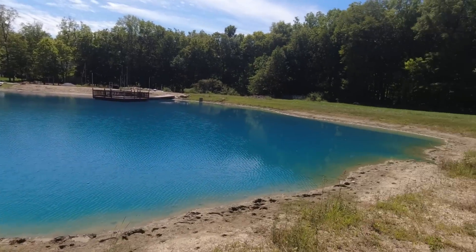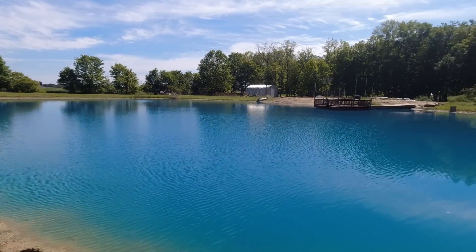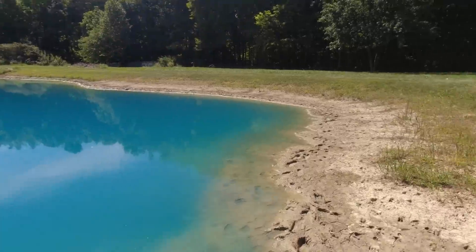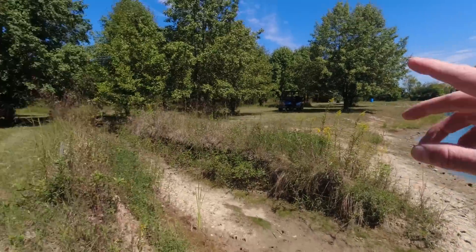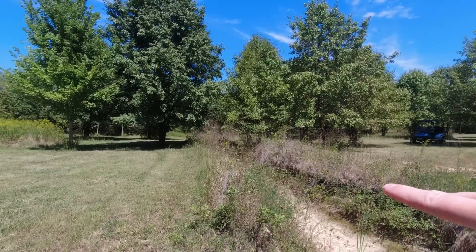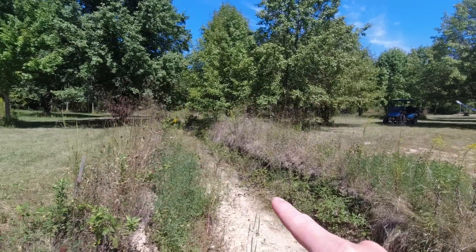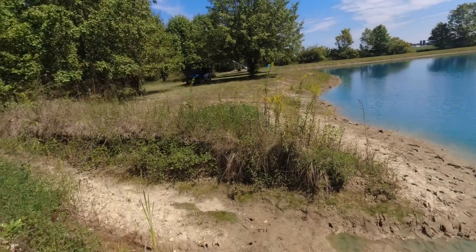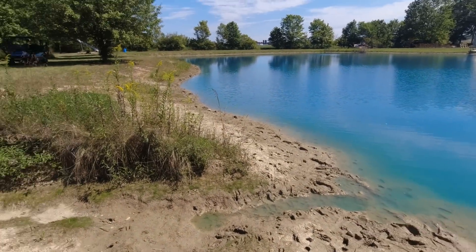Before we make our way up to the overflow, I want to stop here and show you guys this cut. Those of you who've been with the channel for a while will recognize this. I'll put a link to the pond build series — we dug it in the summer of 2019, so it's about five years old, and it has never been full, but it is full of deer tracks. After we dug this pond and put all the spoils out there as the berm, it created a dam, and unfortunately most of this property kind of runs away from the pond. It ended up damming up about a foot and a half of water in the spring of 2020, so I made this cut with my tractor to drain all that water back in here. At the time it raised the whole pond about four or five feet and every spring continues to feed it a good amount.